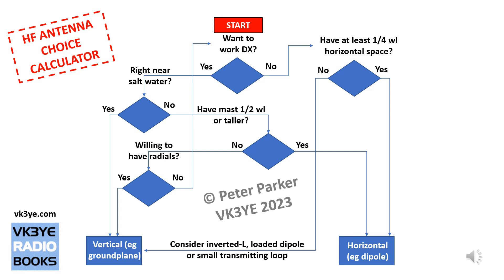If you are forced to compromise — if you can't put up a mast a half wavelength or taller and can't lay radials — then it's going to be difficult to work DX, though not impossible. Let's suppose you just want anything to get on air and aren't so worried about working DX every time. There may still be times you work DX, but it will be harder. A lot of your contacts will be shorter distances — within your own state or country, within one to three thousand kilometres.